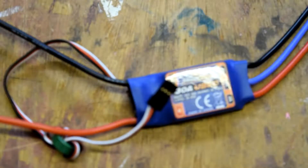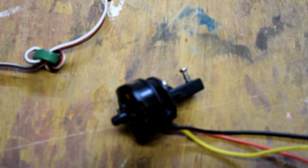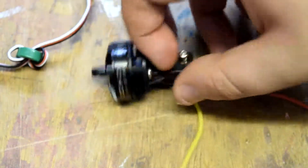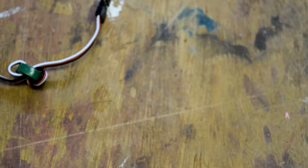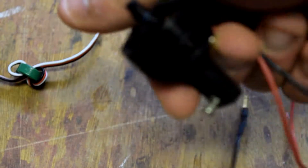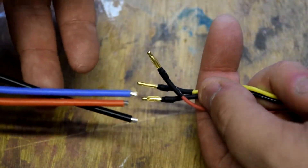So the first thing we're going to be doing - and that's why I've got the more powerful soldering iron on - the little solder wires for FPV stuff. This is the motor from the NanoTalon. The way that this works is basically you've got a screw on the top to hold it from going back and forth. When you undo this screw it just pushes out the back and you've got this really long cable. What's good about that is when you run out of props, you can just put a normal mini quad motor on the back of it. When I get to that stage I'll probably stick on a T-Motor MN 2206 2000kV. That'll be what I stick on the back because the shaft is too short for any of the props. So we need to get the motor wires and ESC wires connected together.